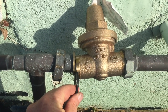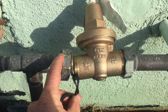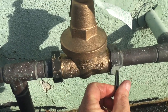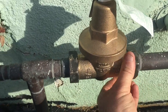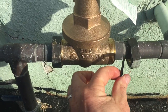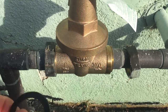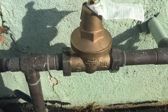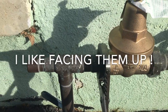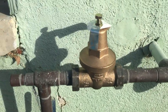What you want to do is just stick your washer in between and then screw this onto the threads. Now that I've got the washer on this side, we can unscrew this one and slide the washer in between there. I'll put the phone down so I can push this back and slide it in. Now just snug it up a little bit with your channel locks. Now we've got a regulator in place.